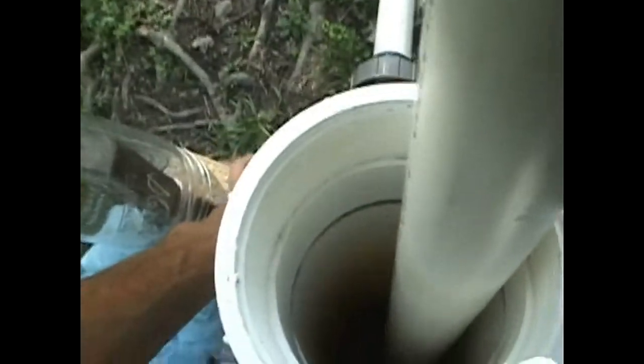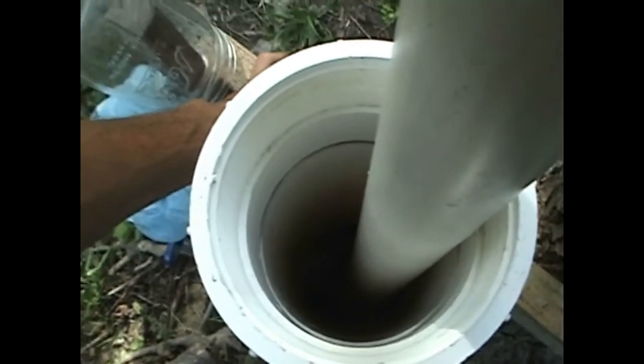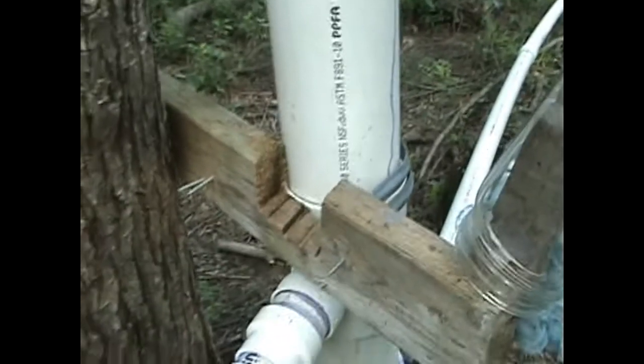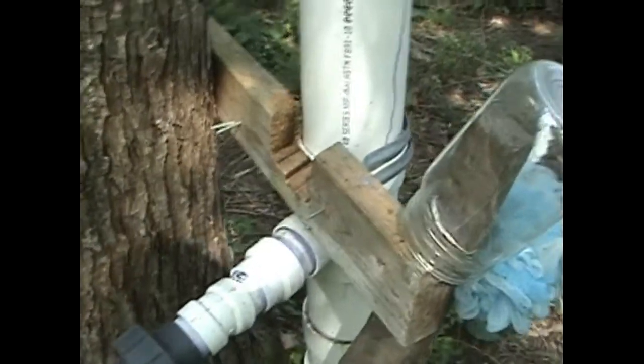I made some adjustments and we'll just take a look down the pipe. You can see that our water levels are much lower than they were earlier in the spring. In fact, we're only about an inch and a half or two inches over the output side of the standpipe here. So that's pretty close — if we get too much lower, our drive pipe will start to take on air bubbles and that'll cause the pump to fail on occasion.